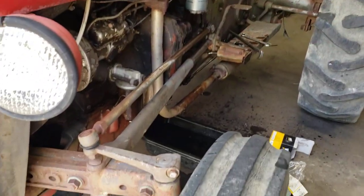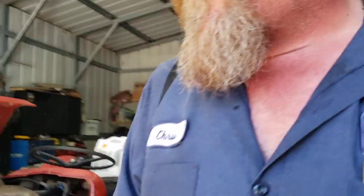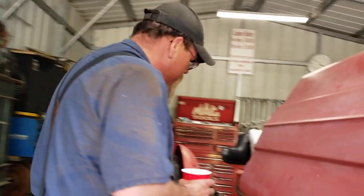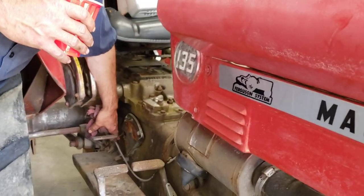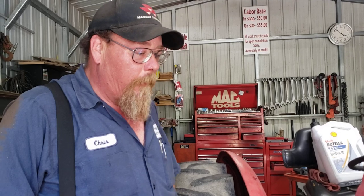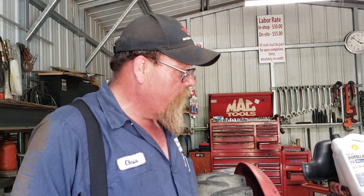You've got your grease fittings at every pivot point — a couple on the back. I'll show you where to check the hydraulic oil. There's a dipstick right here for the hydraulic oil. This tractor doesn't use mineral oil like the old 30 series — it uses actual hydraulic oil. I think that's enough to get you started. If you have any questions, ask me in the comments and I'll do my best to help. Thanks for watching.